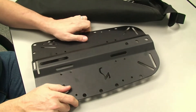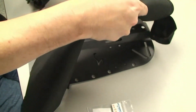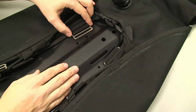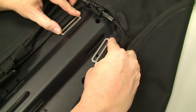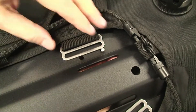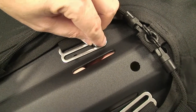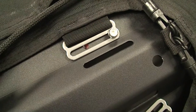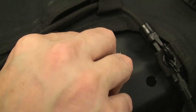For this exercise we're going to mount a stiletto style bladder. We've turned the backplate over. From the back we're going to lay the tri-bars — the bladder attachment strap would go through — over the holes on the backplate. Coming up from underneath we will push one of the bolts through and put a lock nut on it. We're going to do the same for all eight holes, top and bottom.